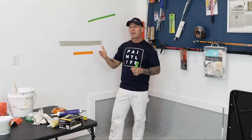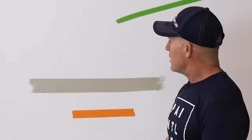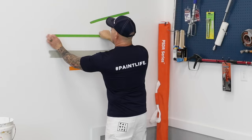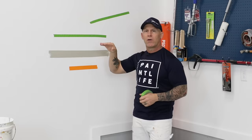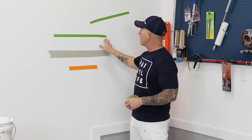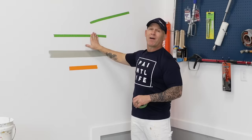A lot of times, even on smooth surfaces, we'll use a combination of caulking and Frog Tape to ensure a perfectly straight line. This wall right here is a super heavy orange peel texture — not a knockdown, but very heavy. If I put Frog Tape alone on this wall, I'm really concerned about paint bleeding underneath, because the high peaks and valleys create voids where paint can seep under. Frog Tape alone gives you 50–75% better edge than standard tape, but for a perfectly straight line, I combine it with caulking.